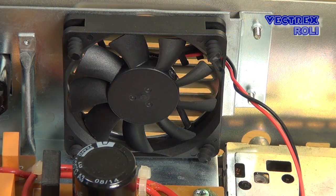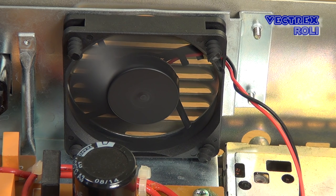The metal case behind the power supply was already prepared for a small fan, but as this is the cost-reduced model, Commodore didn't put one in. Does it make sense now to add one? Well, you will get different answers depending on whom you ask. I can tell you that heat, leaking capacitors and wrong DC voltage are the main reasons why old computers will die, and those reasons often go hand in hand. So I decided to replace the caps in the computer and also did add a fan, as I want to use this machine here on a daily basis without worrying too much about heat, and I don't really care that my machine now does make some noise similar to an old PC.